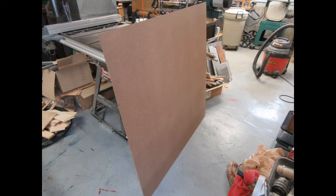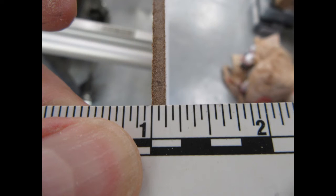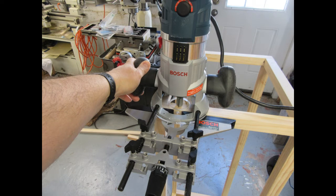The case sides are made from 1/8 inch thick masonite, a steam-cooked and pressure-molded hardboard product. I buy them pre-cut to 4 foot by 4 foot pieces at the local Home Depot store. The 1/8 inch thickness is readily available and inexpensive, and is strong enough for even fairly large cases without weighing very much. The masonite panels will be inlaid into the frame.